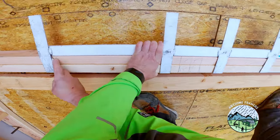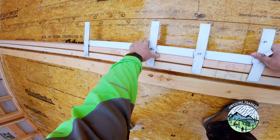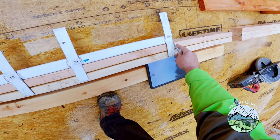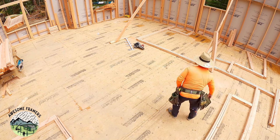Now, line up your layout stick over a seam because we know a seam is going to be a layout. Our joists and studs stack. That's why if all layout pulls from the same wall east-west and from the same wall north-south, nice and easy.